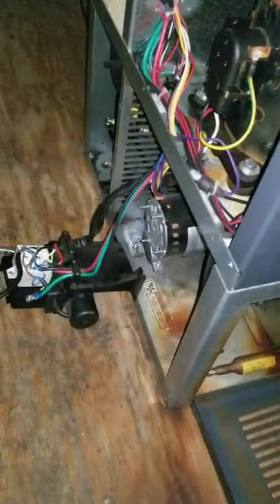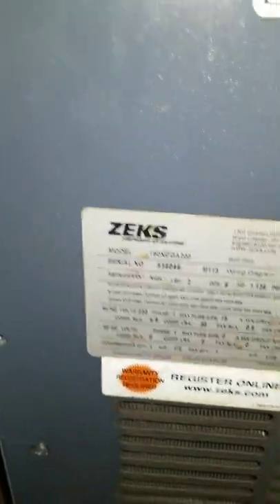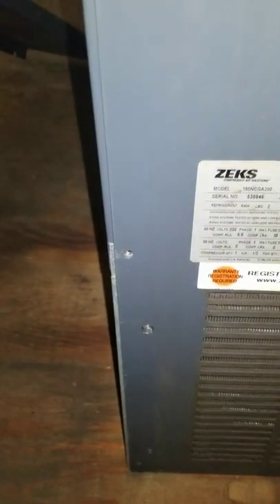Assembly is opposite of disassembly on this, so I'm not gonna make a video of it. She's been running for a little bit now, doing good. I will note one thing: make sure that you screw in all the non-common screw holes — like this one, this one, and the one down in the corner, and that one there — before you try to put the top on. Otherwise it gets really difficult to get that thing on. All these have to be kept loose because the top goes over those and then into that. Keep the screws just slightly loose enough where you can align the panel, then go back and tighten them up when you're done, so you can get these in better alignment for when you put the front on.